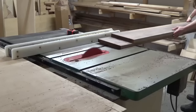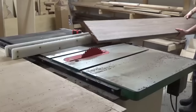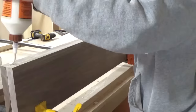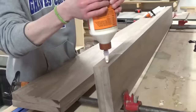I ripped the laminated board edges on my table saw to give me a nice, even, clean edge to glue up. The widths of my final boards added up to 36 inches, which is the final width I wanted my table top to be. Because I was gluing up several boards, I found it's easier to glue up smaller sections at a time. So I laid out 2 boards on a couple of pipe clamps, applied some wood glue to the edge, and clamped them together, trying to keep everything as flush at the seam as possible. I glued up 2 sets of 2 boards and let the glue dry for about 24 hours.